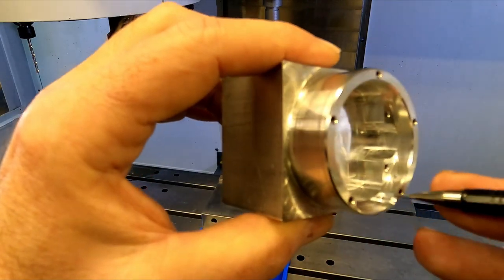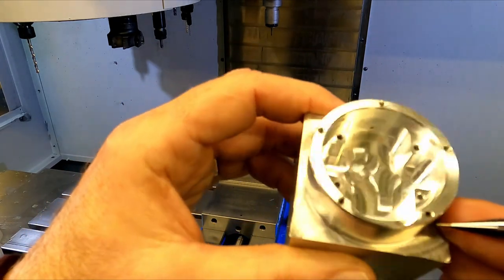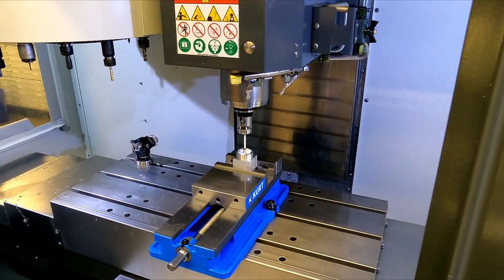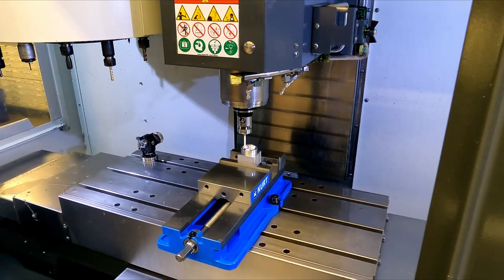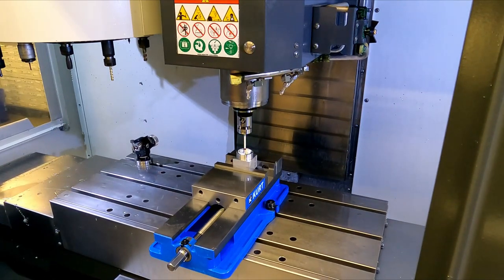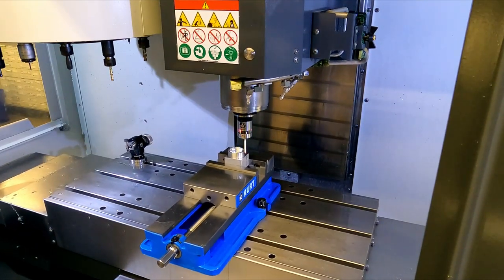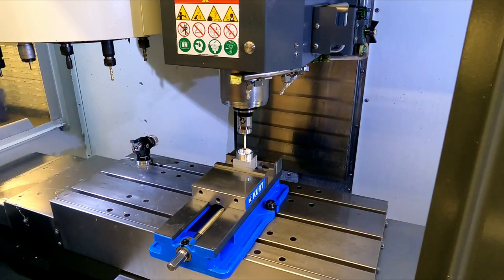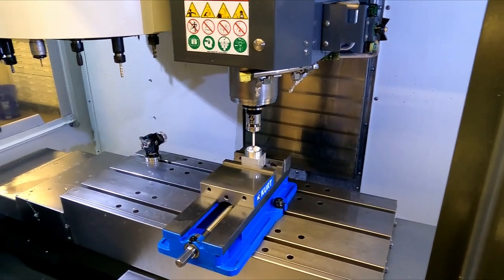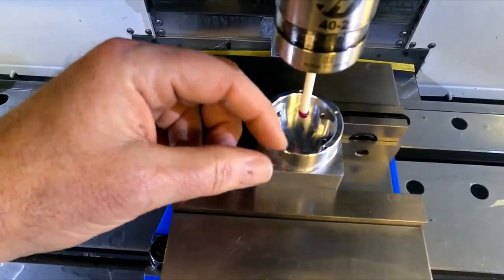So put it back in. We'll try and do the rest milling on these two little corners. And yeah, hopefully I can get it all lined up. So we'll see. All right, let's see if we can pick up the X and Y again here. Let's start with Y. We've got this feature towards the bottom, like it's supposed to be, so it's oriented the right way.